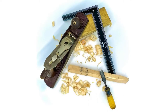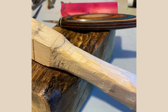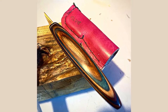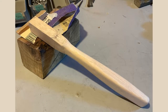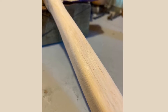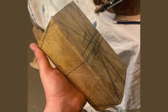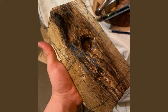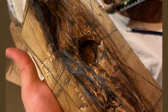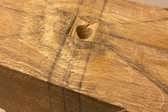I got a fancy new photo light box during this time. I used my whittling knife to rough out the curve of the handle — I love this detail knife from Helvey. With the limited supply they're hard to get a hold of, but my dad was able to track one down for my birthday last year. Then I sanded down to smooth things out — first with 80 grit, then 220 grit sandpaper. Cleaned it up a bit with wood cleaner. Then I cut the top into the double tapered mortise that makes the mallet so rock solid. I found the center of the mallet head and used the handle as a guide for how large to cut the tenon — thinner at the top and wider at the bottom. You'll notice the knot in the wood is close to the center of the head. Aside from giving me a jump start on boring out a hole, I knew this was going to make precision very difficult to achieve. Still, onwards I went.